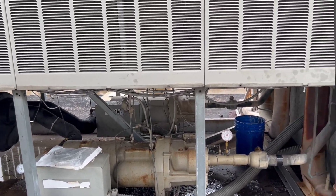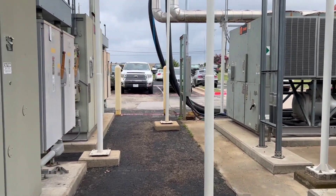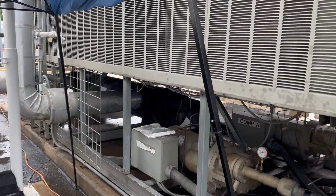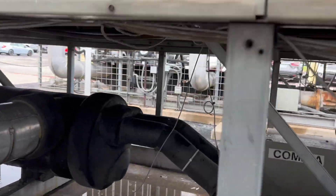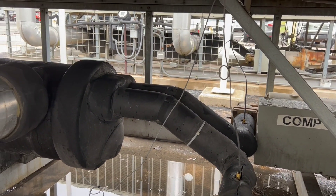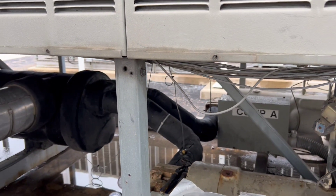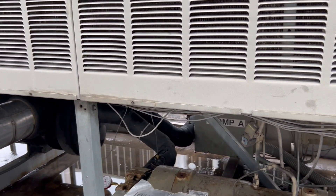What's up everybody — I'm back at this place again. My last few videos I worked on that chiller right there, but now I'm working on this one. What I found is the refrigerant saturation temperature — that is measuring the saturated temp coming into the compressor — I found that one reading off by about 8 to 11 degrees. Go figure, it's a Trane.